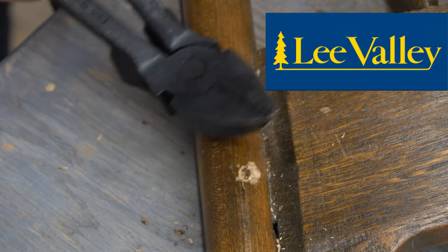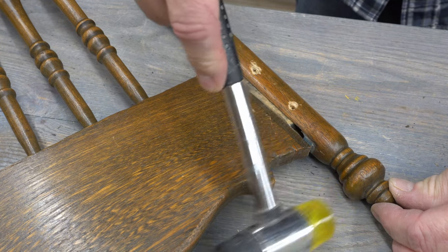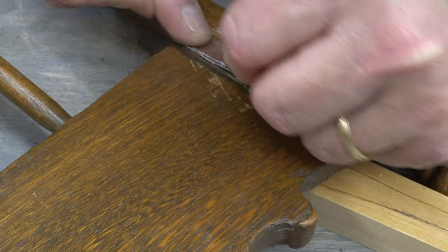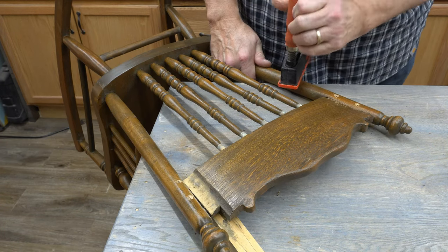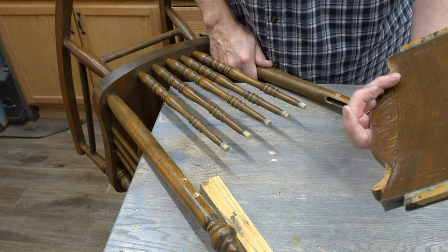These pliers have a curved bottom allowing you to rock the nail out a little more gently, minimizing tool damage to the spindle. I got this from Lee Valley Tools — they're not a sponsor, but they're a good supplier for specialty tools like this. I wanted to do some sanding to the seat back tenon before attempting to glue it back in. I thought I might have to work a bit to knock the spindle free, but those rusty brads seem to be the only thing really holding the top of this rocker together. The entire seat back lifted up and away from the back spindles without even a whimper.